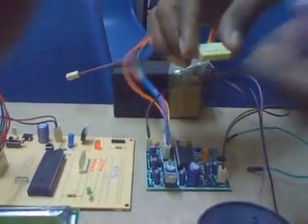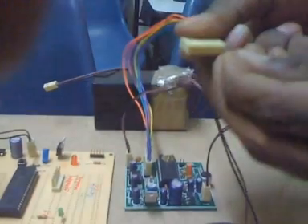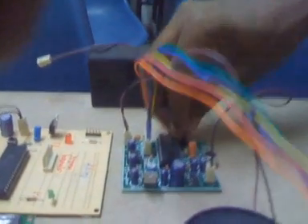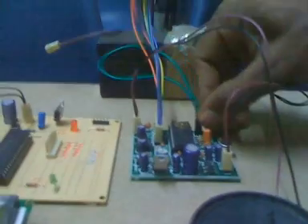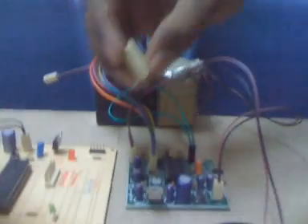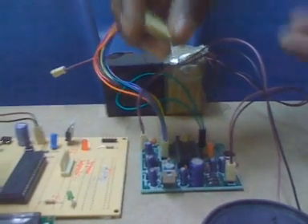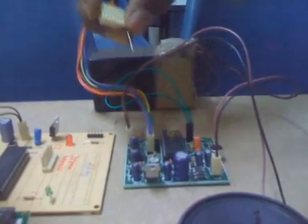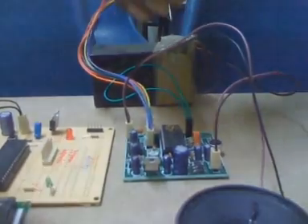These are all predetermined. Now I will start recording. This is the first pin — I place the jumper in the first slot. I short these two pins, putting the module into record mode. When I connect this to ground, you will hear one beep. After the beep, you can speak anything into it for up to 7.5 seconds. After recording, remove it from ground and the voice is saved. A second beep indicates the end of the voice.